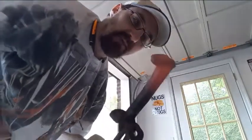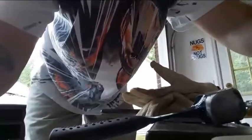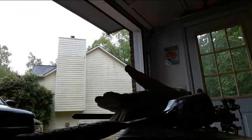And the phone moved, but you didn't miss much. I was just straightening out the sides of the railroad spike. I'm going to get this hot again because I'm about to take, where's a good pointer? I'm going to take this part right here and lay it down and smash down on top of here. So set a diagonal and smash in right here to lay this out flat. I'm going to throw this in here for the next heat and then get the phone reset. Okay, I'm going to pause this while I find a way to secure this a little better.